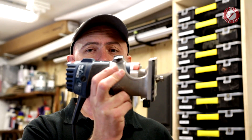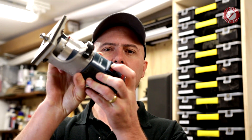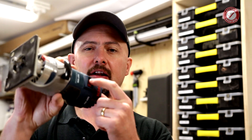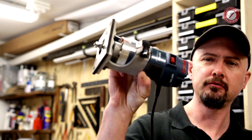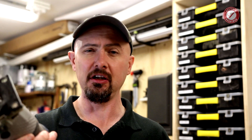That's not like this sort of switch on a router, where it's literally a toggle on/off switch. If the power goes off to the workshop and that switch is left in the on position, as soon as the power comes back on to your workshop, your machine comes back on. I would certainly advise having NVRs connected to any machine that's vaguely dangerous that you're going to use in a latched-on position.